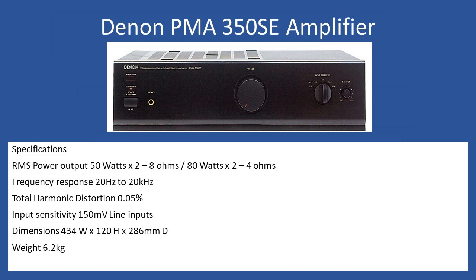The amplifier also supports a remote control. You can see the small IR port on the front panel. The remote performs two functions: it raises and lowers the volume control, and it can place the amplifier into mute, which de-energizes the speaker protection relays — indicated on the front panel. Note that input selection is not via an integrated circuit; it uses conventional manual selection via a multi-pin switch.